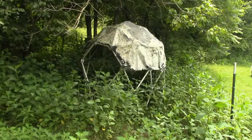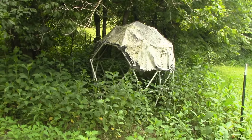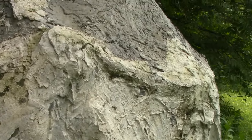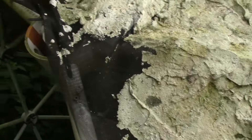Here's the same dome nearly four years later in July of 2023, and it really has not changed other than being covered with tree leaves. It doesn't leak, and it holds up against the sun and rain. My lack of finesse with the trowel is still evident, written in stone so to speak. I also noticed that adding a hard concrete shell to a hub-and-strut dome like this makes the dome much stronger, as the shell envelopes and holds the struts, locking them all together.